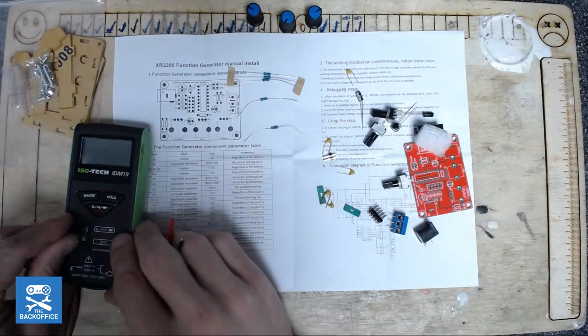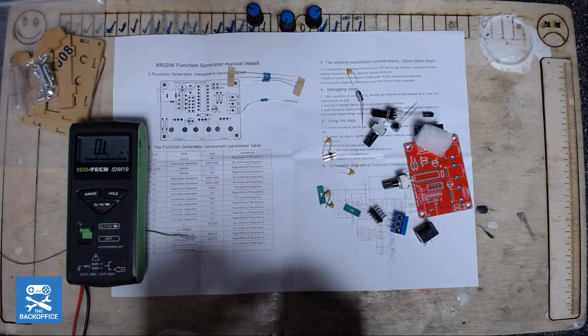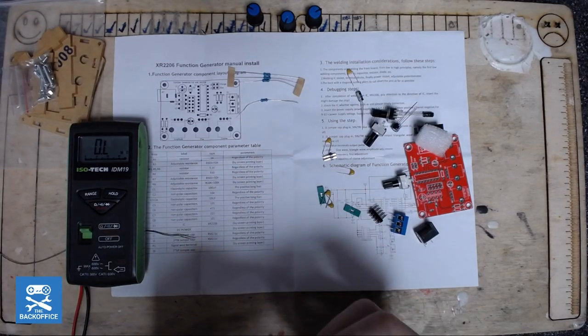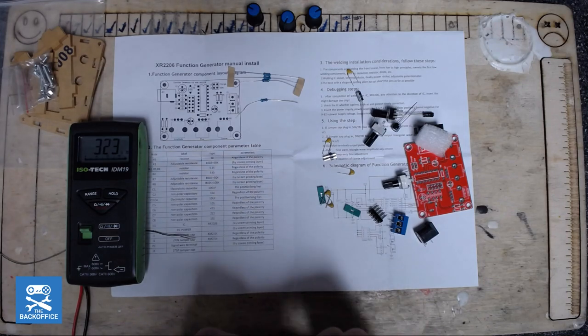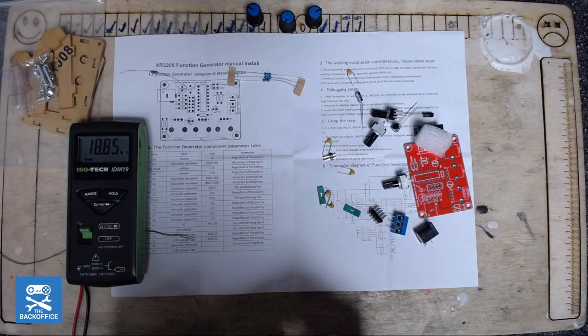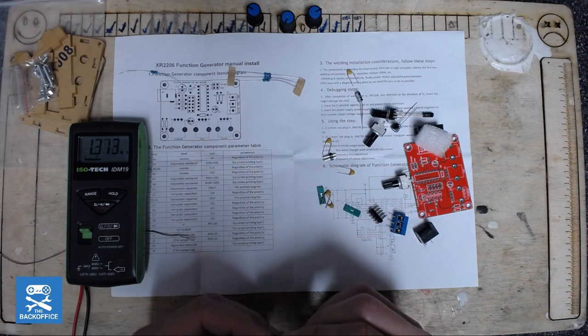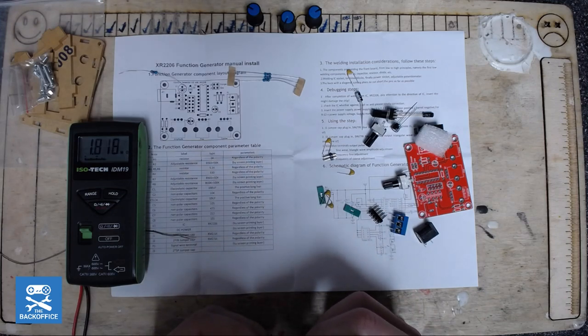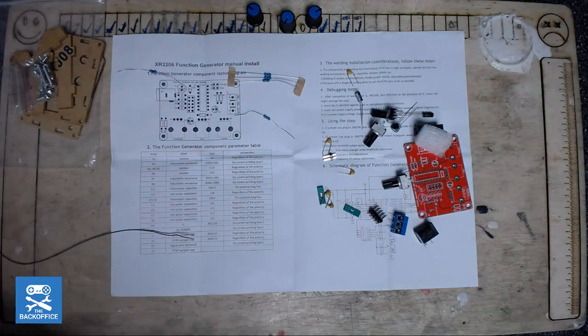Fortunately. And I'm just going to use my multimeter here. Electron Ash, you certainly seem to be enjoying your cider last night. 0.323K. Put that there. That's a 330 ohm and a... still thinking about it, a 1.3 meg. Yeah, I'm not seeing a 1.3 meg in our list of parts here, so let's come back to that one.